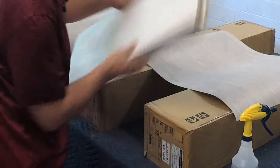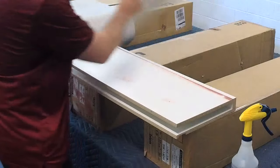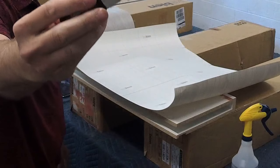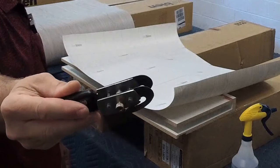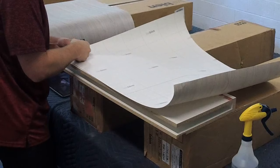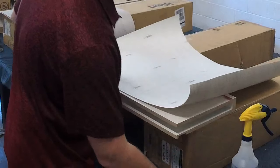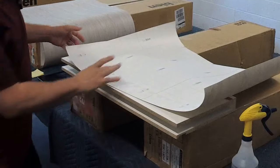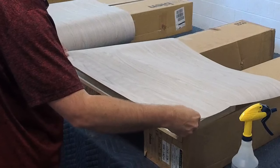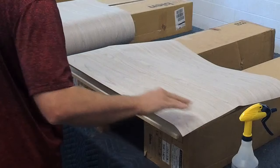So this is the wall side right here. There are two different ways you can do this. I like using the Bodyguard double cutter. What that does is I'm going to tack it on — I'm going to go about two inches in. It only cuts the paper, not the vinyl. So this is what I call 'tack it on' — so I can actually adjust it, move it around, and get it to exactly where I need it to be. Make sure it's overlapped and tacked on.